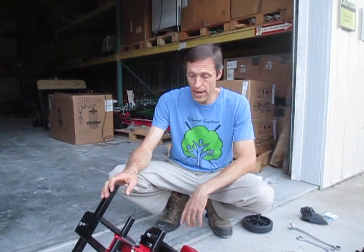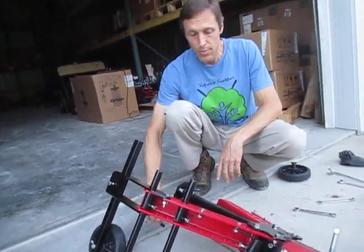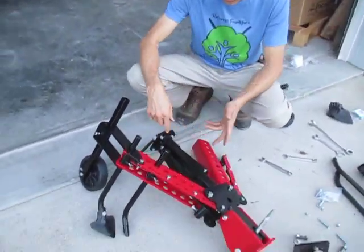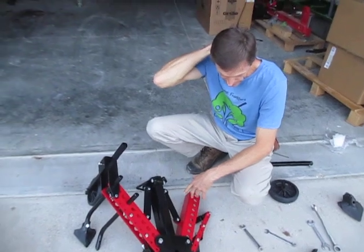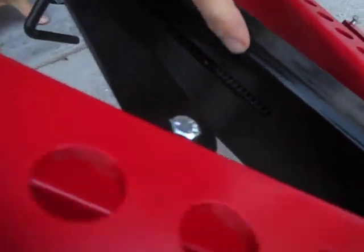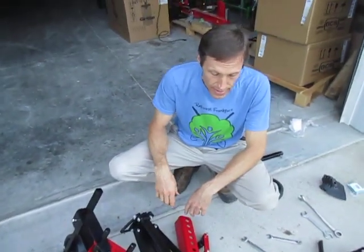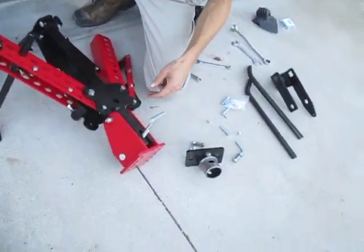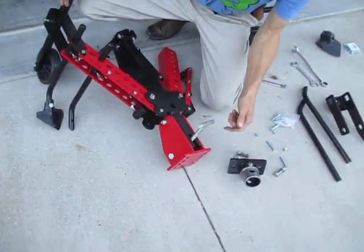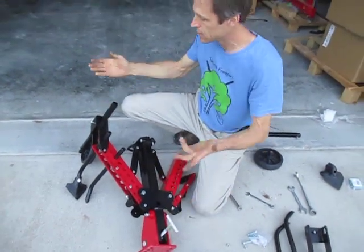That's it. There's really no maintenance to this other than the screw crank that moves the frame in and out — if you let it sit outside and get rusty, it might seize up. But there's an open slot on the side where you can see the screw, so you can spray some penetrating oil or spray grease in there occasionally to keep it moving. The pivot pins up top shouldn't rust much, but you can hit those with penetrating oil as well where the angle adjustment assembly moves. The rest of it is just like farm equipment — it'll sit there and last forever. Thanks for watching.